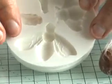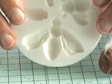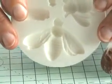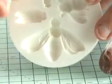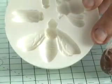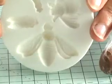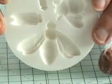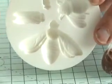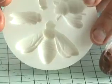Also, something that I'm quite keen on doing with these are sugar crafting moulds, and they come very large, sometimes certainly far too big for using with silver, which makes them too expensive to sell. So what I do is I make a first cast of them, and then when it's fired I then make myself another mould and I keep reducing them down smaller and smaller. So I get a whole range of different things, particularly insects, which I can use at different sizes and different projects. Also, what I do is to preserve the detail. When the piece is in the dry stage, I tend to carve it and burnish it so that I can keep a sharpness to the detail when it's fired, but also it's nice and sharp and crisp for when I make the second and the third moulds from it.